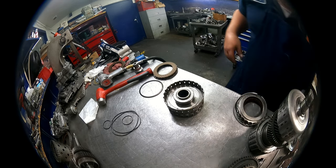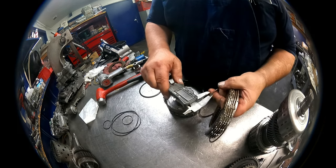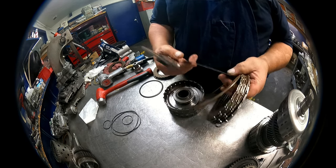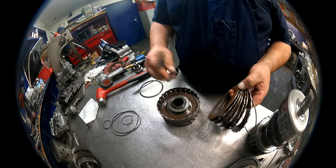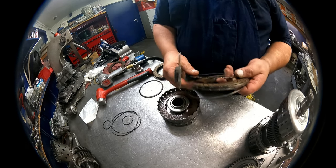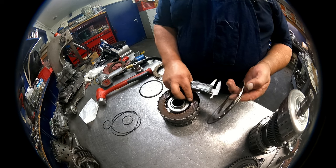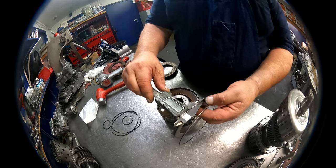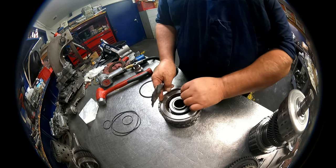Okay, on our fifth gear side, cushion plate dished down 56 thousandths, steels 62, clutches 79. Like I said, the pressure plate is selective, but I'll tell you what mine measures. .237 overall. This is where they actually measure from. This one's 91 thousandths. Snap ring is 71 thousandths.